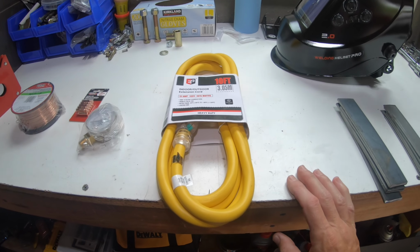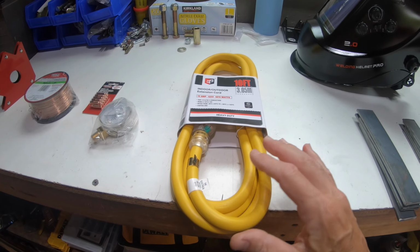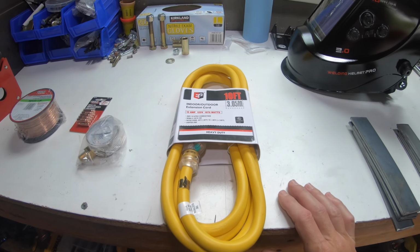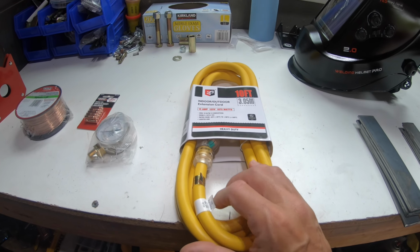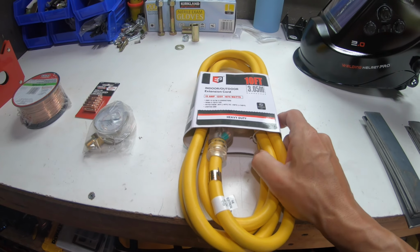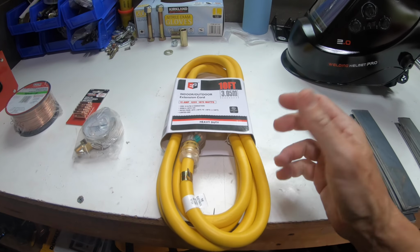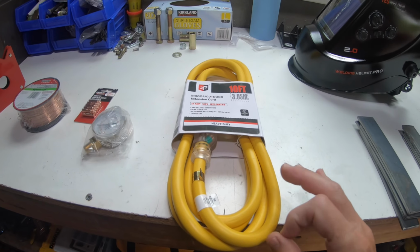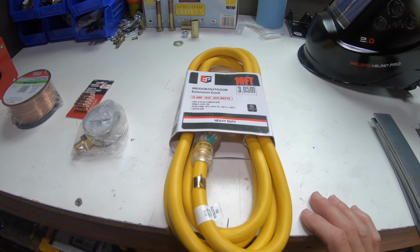I had one of the subscribers leave a couple comments saying that I really should invest in a heavier gauge extension cord since I need one for the MIG welder. So I went and bought this 10 footer. It's like a 10 gauge wire, pretty heavy duty. I want to keep it really short, just as short as possible. And I think 10 foot will work. I'm just going to be using it in my garage, and that's going to help out.